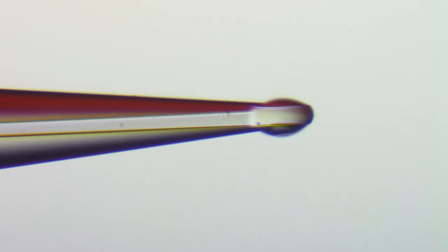Once I have the right voltage, I can stop and restore the liquid flow and the cone will come back where it was. Let's get closer. The pattern repeats as expected. And there we are — we can even see the jet.